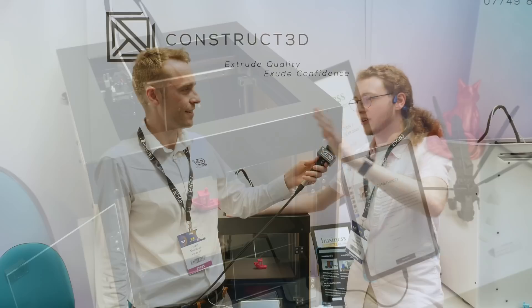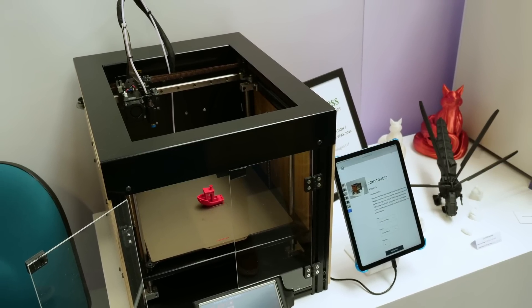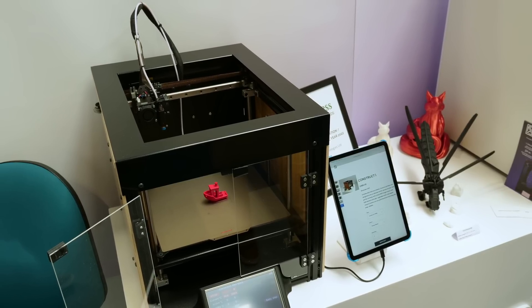So developing from lots of separate DIY solutions into something you thought you could do a little bit better? Just a little bit. The very first prototype of the Mini was an Ender 5 that had only one part remaining - the frame. Every other part was gone: the plastic brackets were replaced with steel, we slapped in an E3D Aero, added a strain gauge, a PEI bed, and all that - and that was really the start of how it happened.